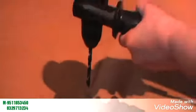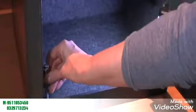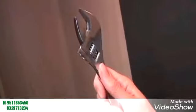When it comes to installation, position the safe at the bottom of a secure wardrobe or built-in cabinet, then mark each of the holes at the bottom or back of the safe. You can take the shelf out so you can mark each hole more easily. Next, drill a hole where each of the pencil marks are, using the appropriate drill bit. Place the safe back into position, turn the interior light on, and secure using the plugs provided. Tighten with a spanner to fix more securely into place.